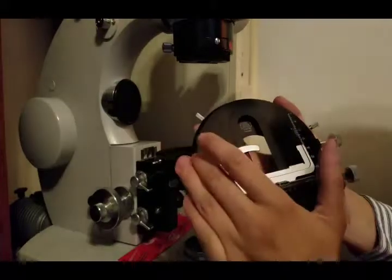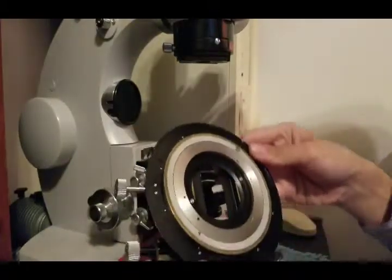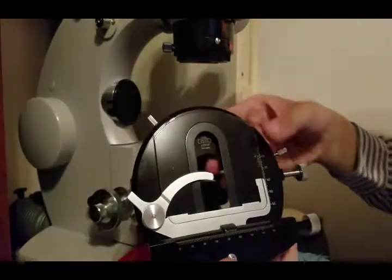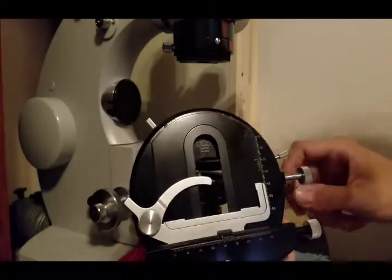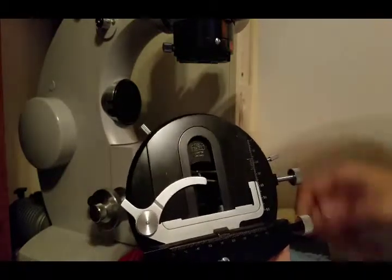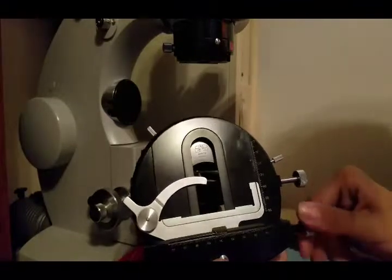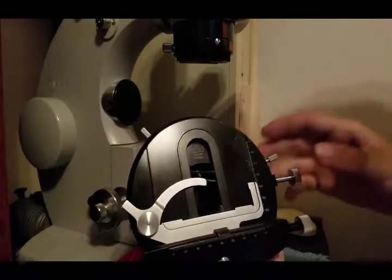This was nearly completely seized when I got the microscope. I had to take it completely apart down to the bare tracks and pinion gears, and I was able to grease it with a lithium grease, which really made the whole difference. The stage is relatively free of scratches, and it works really smooth. I had no issues with teeth being damaged on it - it works very, very well, almost better than the newer microscopes we have at the college.